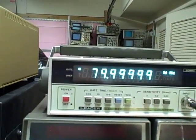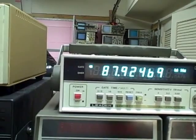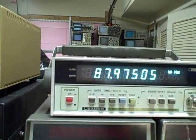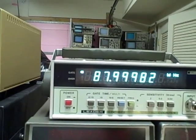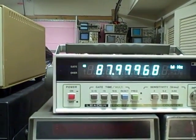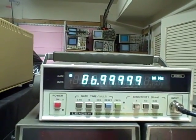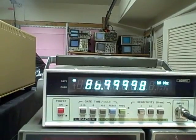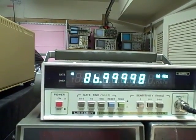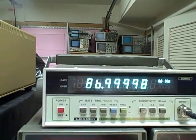If I kick this thing up another 10 megahertz, we see that the frequency drops. But if I take her down just a megahertz or two — like here we are at 87 — we are accurately reading at 87. So we're getting six or seven extra megahertz above the rated specification, which is good. You've got just a little bit of extra room there.